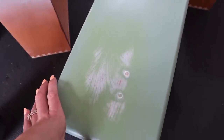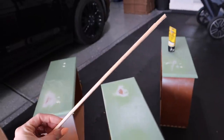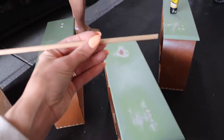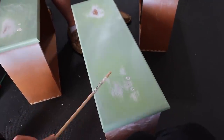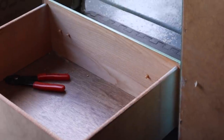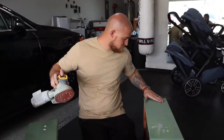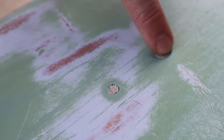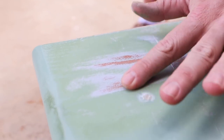It's not going to hurt anything — this one's completely done and this one is ready to be painted again after sanding to make sure everything is flat. The dowel Frank used is like the little wooden pegs that come with flat-pack furniture. He put the dowel in, sawed off the excess, added a little wood filler to smooth it out. You can still see the ring slightly but when you rub your finger across it, it's nice and smooth.